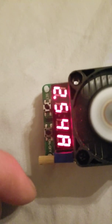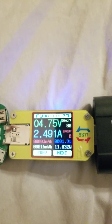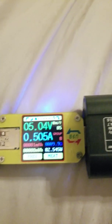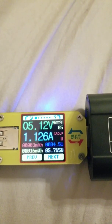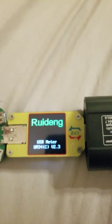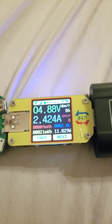At about two and a half amps it wants to cut out. Now let's check the other port. Hooked into the two-amp port, drawing an amp — let's bring it up. Again, two and a half, about 2.58 amps. It does not matter if you're in the one-amp or the two-amp port — they'll both pull about 2.5 amps out.